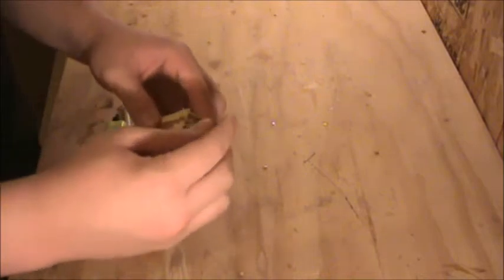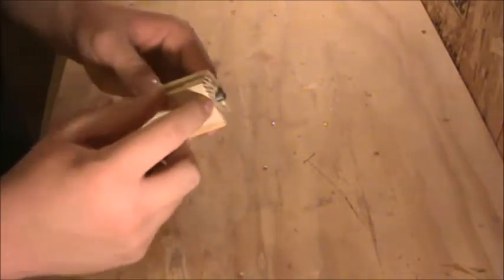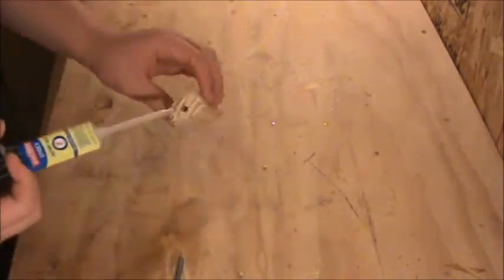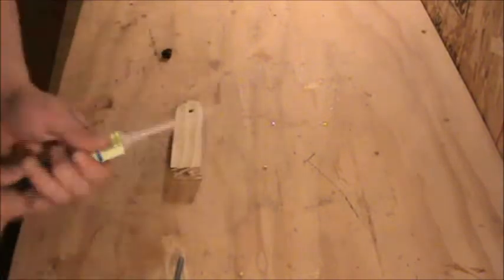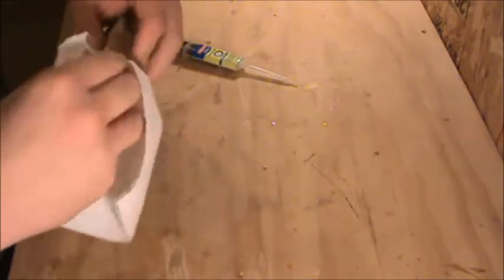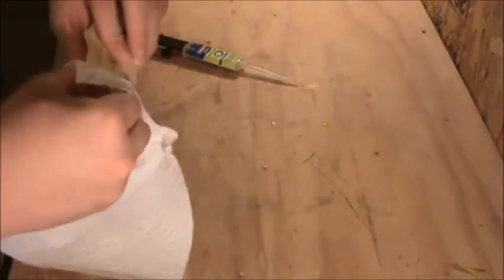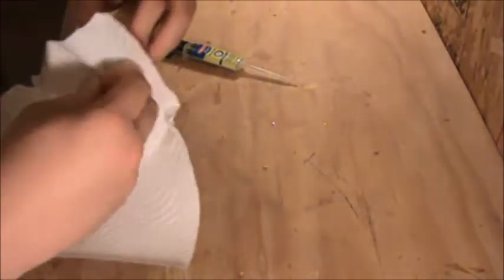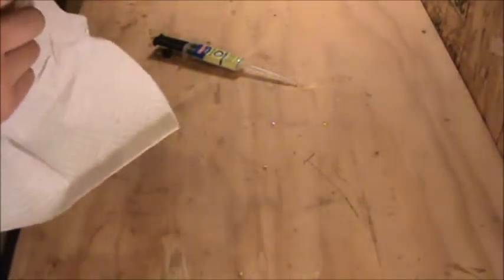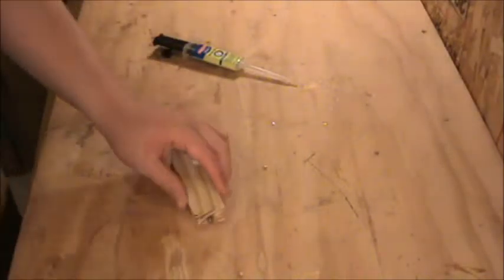In the top piece of this camera mount, I've taken a piece of all-thread and cut it to length so it will fit in the mount with just enough for the camera to actually screw onto. I'm going to secure that in there with some epoxy. You want to be sure to get any squeeze-out off as soon as you can, because once it hardens it becomes like a plastic and you won't be able to get that off. Be sure to get any off the threads. Even if you use one-minute or five-minute epoxy, if you read the fine print it's not supposed to handle stress for 24 hours, so do keep that in mind.